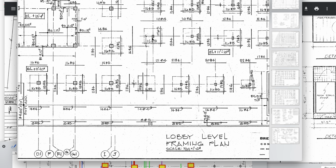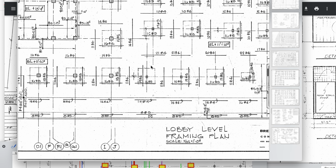Well, it's direct, it's pulling direct, but across these steel members. But it's also loading between the two spans from here to here. And that's a large span, and it's only across the two rabbit ears and one piece of steel and the dead loading of the deck, trying to grab it. One steel trying to, and this is what I talk about, pull out, trying to grab one piece of concrete to the next, like one link of concrete to the next in this embedded steel.